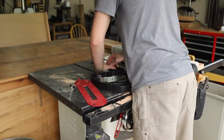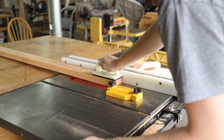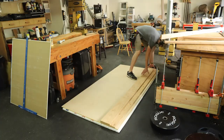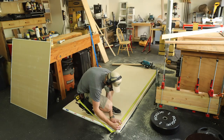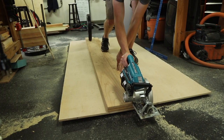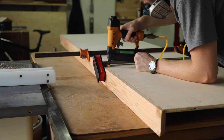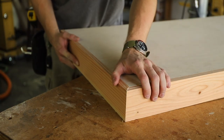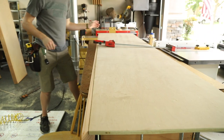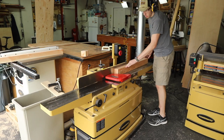For the actual construction of the top, I created a dado in the four pieces that were then mitered together. Inside of that I put the pieces of plywood, which I first cut down into two halves, and then to further secure the joint I added a couple of brad nails as well. This is where you can see that having a larger assembly table slash outfeed table would be really nice — instead of cutting everything on the ground and hurting my back, I could be upright standing with a saw cutting on the table.